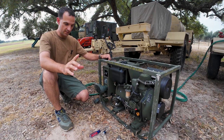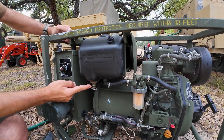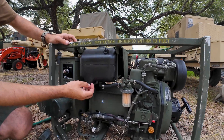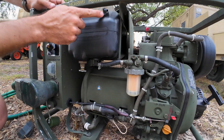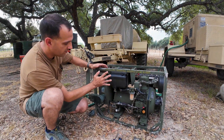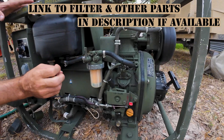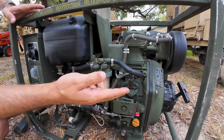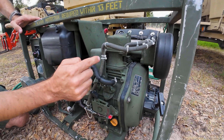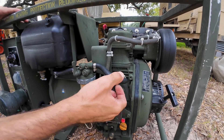Before you even mess with anything, make sure that this fitting right here is not going to leak. This one already had a brass upgrade on it. A lot of them have the same rubber fitting that the larger generators have, and they'll be rotted out — as soon as you put fuel in, it's going to start leaking. Make sure the tank isn't too dirty; this one was in pretty good shape with only about 20 hours. Make sure the bowl is clean — that's why I got a new filter and a new O-ring. This is 5/16 fuel line. Make sure it is not kinked and when you run it from here to the fuel pump, it does not go higher. That's why I put this zip tie here.